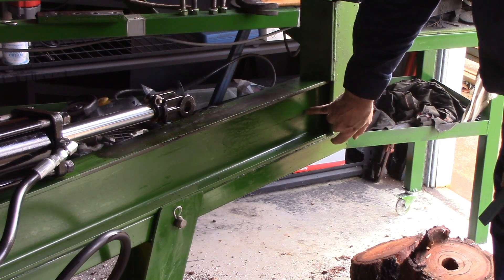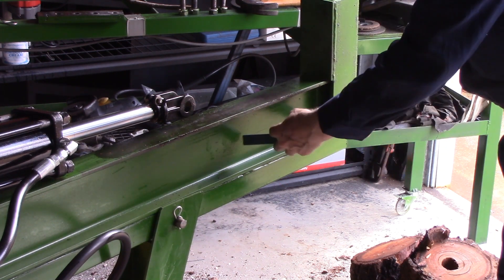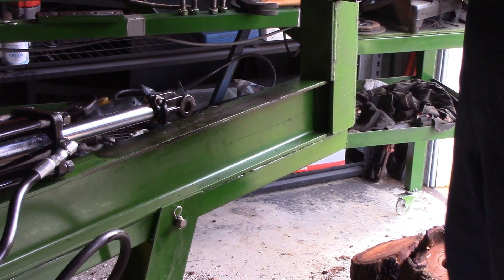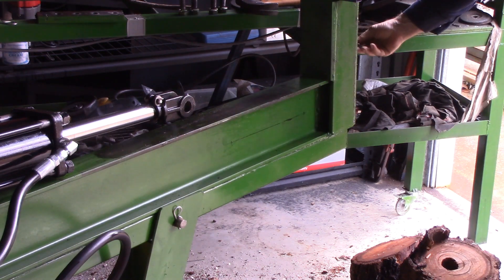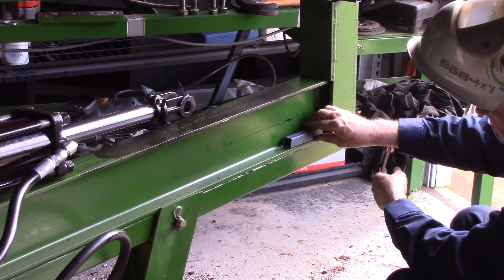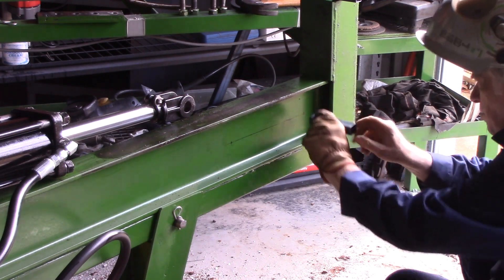I measured back about two and a half - two and a quarter inches I think. That way it's just under 12 inches long, about 11 and a quarter inches long between the post and two and a half inches up from the inside of the bottom flange. But again that will depend on what material you use and how you decide to attach it, so those measurements aren't hard and fast. You'll have to make it to suit your job. I'll use some thin 6013 rods, the 2.5mm which is 3/32 of an inch. I'll try running them somewhere around 70 amps. There's only a 10-degree angle on it, so I need to be a little bit careful and make sure I get them all facing the right way.